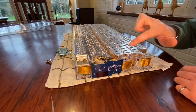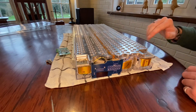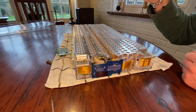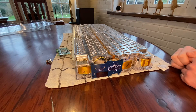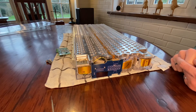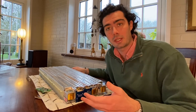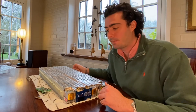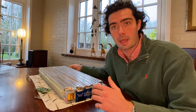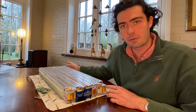That does hold it quite securely, but then put the little pins in — just push them in carefully and don't break them. The daughter board is now replaced on this 5.3 kilowatt hour Tesla battery pack. Put the plastic covering back on: lift it up by the side rails, place it underneath, place it back down, and the thin one goes over the top. After clipping those together, I put a little bit of clear tape over each edge just to hold it all nice and secure. Thanks for watching — like, comment, subscribe, and let us know in the comments what you want to learn next. We're going to show as much technical detail of our builds as we can to help out DIYers and anyone wanting to learn more about EV tech in conversions.